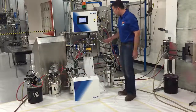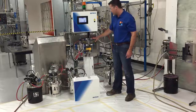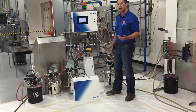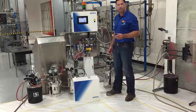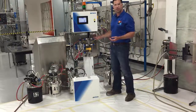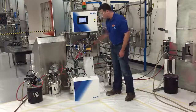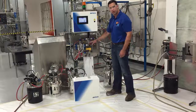At some point in time the pump is going to need to be rebuilt and cleaned out. Or if it's not being used often, one of the most common things we see people doing is they want to flush out the system. Any solvent that we use has some percent of water within it. When solvent comes in contact with isocyanate catalysts or any other moisture-sensitive catalysts, the material can end up hardening up. So if we ever need to clean this out, we always recommend that you do flush out the system, but after you flush it out, you actually take apart the dispense pump in order to clean everything out so you don't have any excess residue in the line.